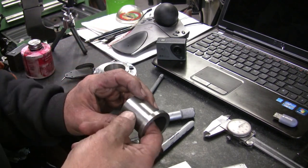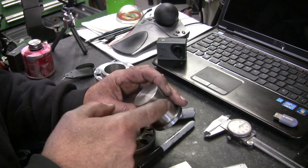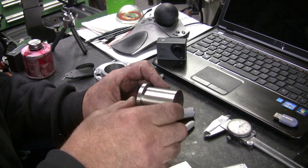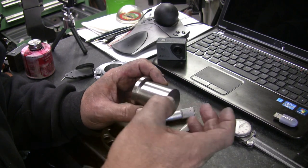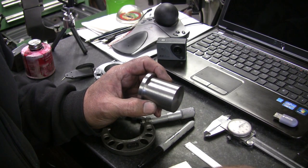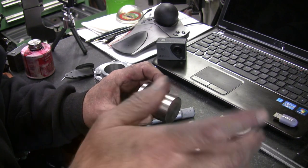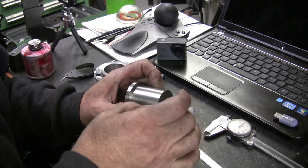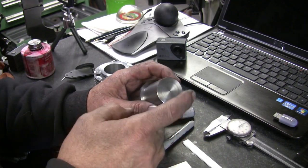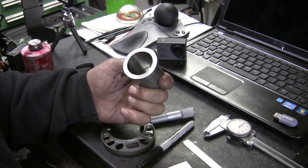You know, I could have made the walls thinner, and then it would have taken less time to heat up, but what I should have done was made this 2.25 inches long, left heavy material on the end, like I did on my Stirling fans, because then you heat that up, it'll hold the heat longer, and when you take the flame away, it'll continue to run because you have heated up this block on the end. Right now, the end of this is 100 thou thick, and this is at 50. We'll see if it works.